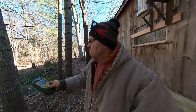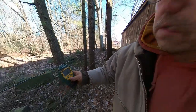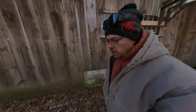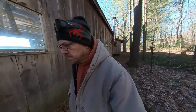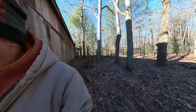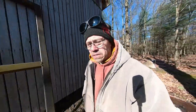We're at 7,000 volts out here, which is good. To be honest, to put a grounding system in, you're really not going to know how many ground rods you're going to need until you get started with it. I'm going to show you how we put our ground rods in before we walk out to look at the end of our grounding system.